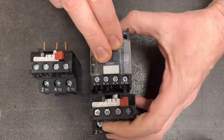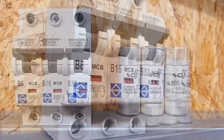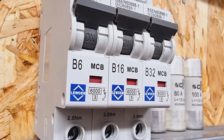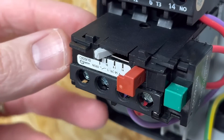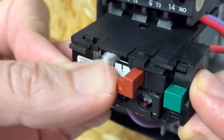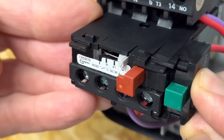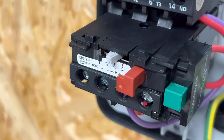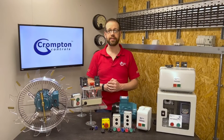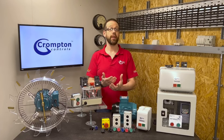We're used to seeing overload protection provided by things like MCBs and fuses, which generally have a single rating like 6, 16 or 32 amps. However, motor overloads usually have a little dial or slider on the front that allows you to adjust how much current will flow through them before they operate. This means the overloads can be used across a range of motors, and the operating current can be adjusted quite finely to avoid causing damage to the motor if it's asked to do something it can't cope with. The overload and its dial or slider will be set to just above the full load current, or FLC, of the motor — the maximum current the motor is expected to draw without damaging itself.